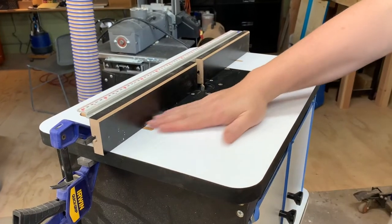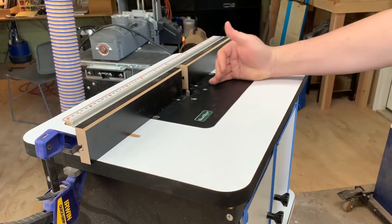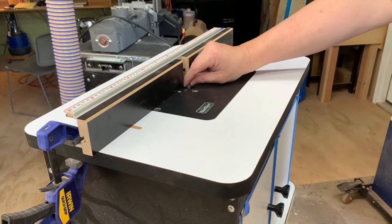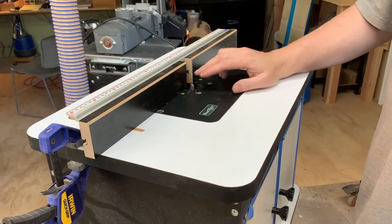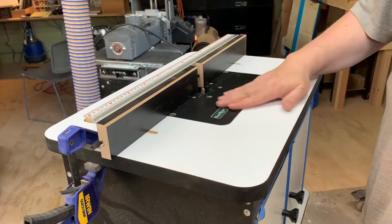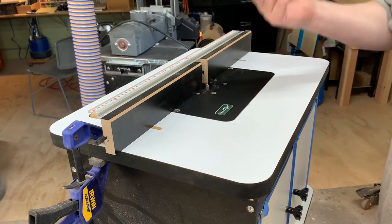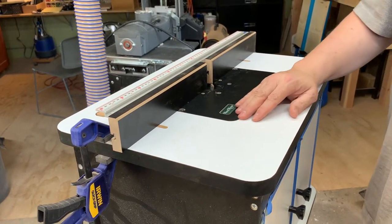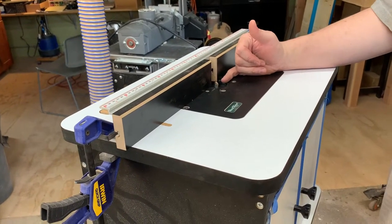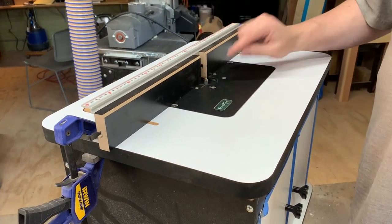Okay, so this is the setup I use to cut the trench in the back of the box at the bottom and the top that accommodate the dowel. This is a half inch bull nose round end. I'll put a link in the description for where you can get one of these on Amazon, most likely. It's just a Whiteside half inch round. The ratio that it is set into here is a trial and error thing that I have found. My router table is marked to where this is.